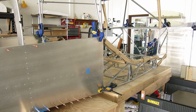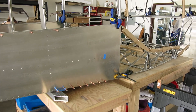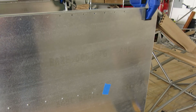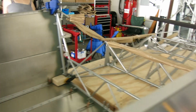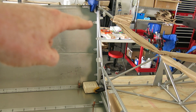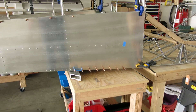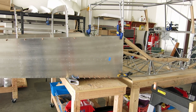We're calling it a day up here. Not much visual progress, but we got to the point of getting the tail cone aligned with the cage. We've got it clamped in for right now, there and there and on both sides. We're going to need to fabricate some shims to go in between the skin and those tabs right there — that's a little ways off yet — but this is a really major deal. This is something you cannot screw up, so we are taking our time with this one.